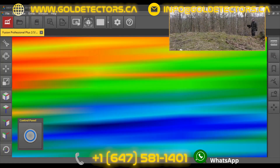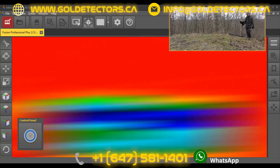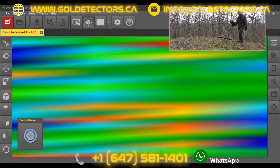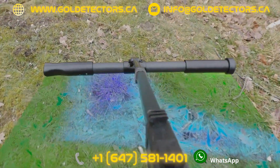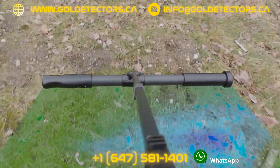Click the trigger button to start your measurement. You can move the probe forwards and backwards to see changes in the underground live on the screen. Do not rotate the probe around its own axes to avoid scan failures.